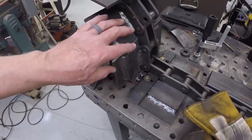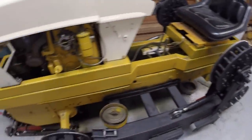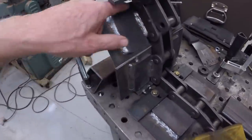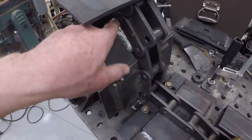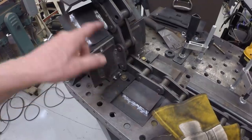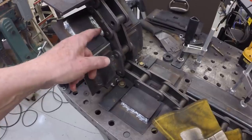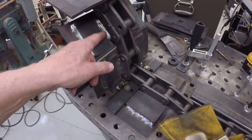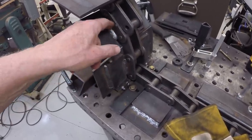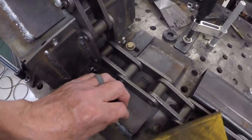But I did take the whole chain off with the three pads and run it on the idlers, and it runs fine through them. So I think that there's plenty of clearance where the weld is against the chain link. I think they're going to have no problems traveling through the idler wheels. The only concern is the bogey wheels, which have a little more space between the wheel and the side of the chain. So I'm set up here again.